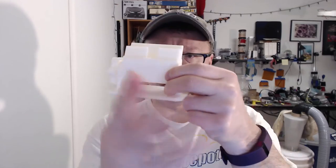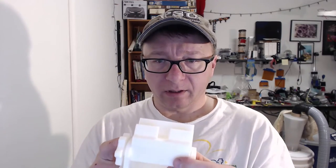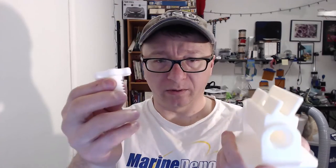That's when I learned something in Fusion — I actually designed this part in half and just mirrored it. I learned that if you mirror a left-hand thread, it turns into a right-handed thread. So I only made one type of bolt — a left-handed thread — and just printed two of them. This guy gets in about that far, and that's about all the further it goes.